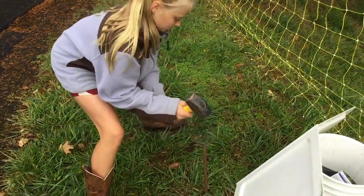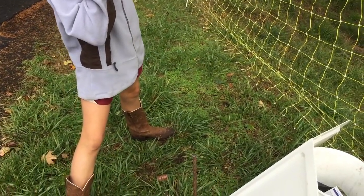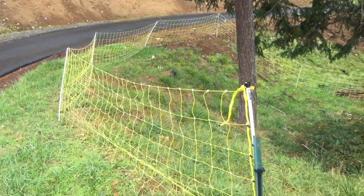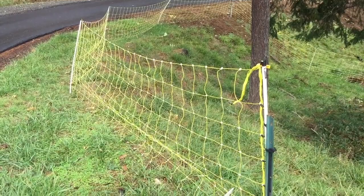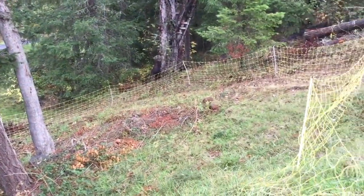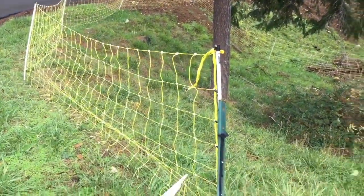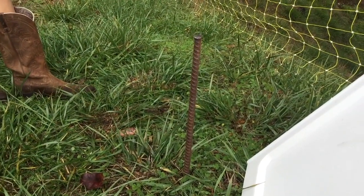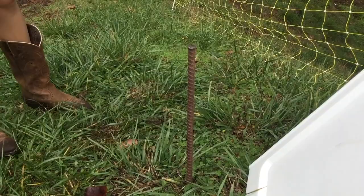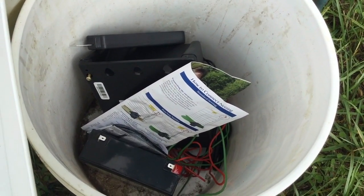Not sure how deep it has to go down - people do it different ways with different types of ground rods. Because it's on a hill, this fence is super skiwampus, and it's hard to get it all straightened out and make sure the bottom isn't touching the ground to ground out. It definitely does have character to it. We'll just have to see how it works. We have about a little less than a foot sticking up, so we're going to try it. If we need to put it in more, then we'll do that. We'll start getting everything hooked up to the Energizer and get that hooked to the battery.